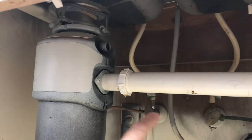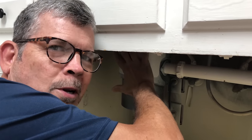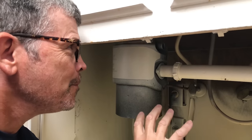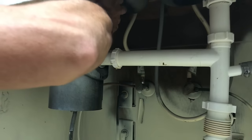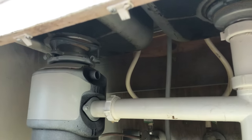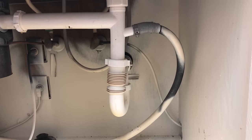I know people who won't connect the dishwasher to the disposal because they say the detergents corrode the disposal. But doing it this way just makes life way more complicated and this is fine. There's a knockout plug in there, so we're going to knock that out, put this hose there, and redo all this. For aesthetic purposes it makes it a lot less cluttered in here.